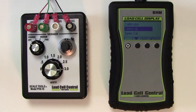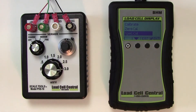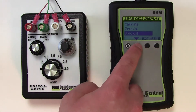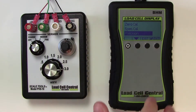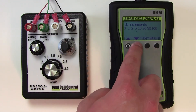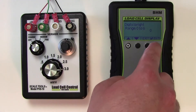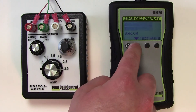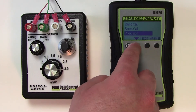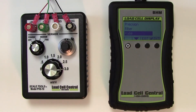In addition to the live calibration, the BHM also supports a zero only calibration and a specification calibration for use with millivolt per volt sensitivities. The BHM also has parameters for the count by and decimal points in precision. The filtering settings can be changed in filter, the display update rate in rate, and the power and backlight timeouts in timeout.